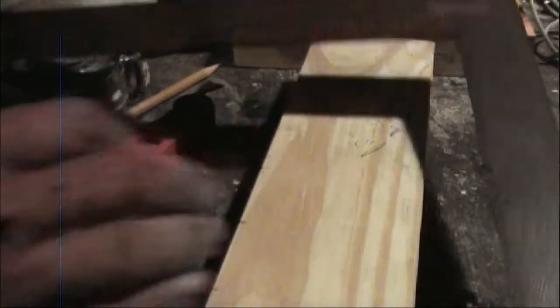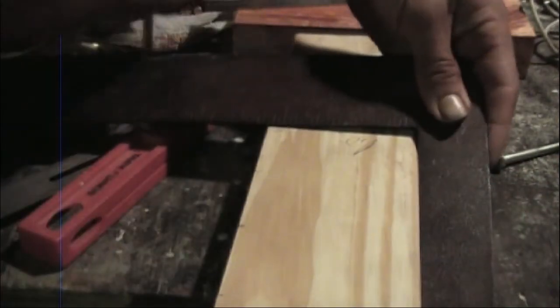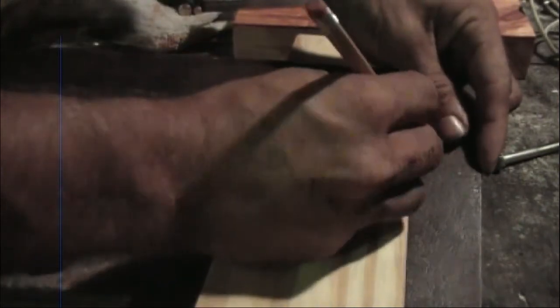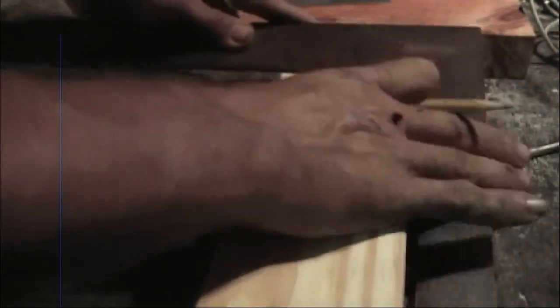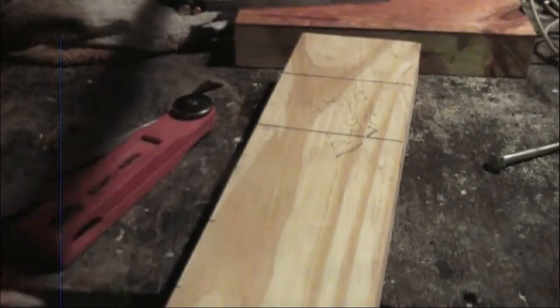And we'll do a very similar technique. We need that square line, so I can hold it deep down on that edge and get that square line. That way I'm not affected by that round over. There's my square line. Alright. Now, for this technique you need 2 square lines, since you're not going to have an angle gauge or anything like that.